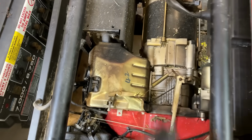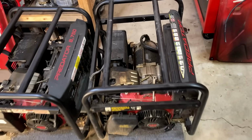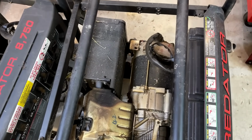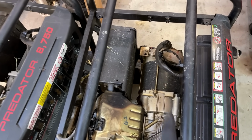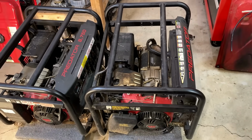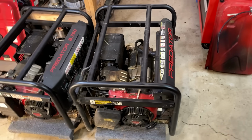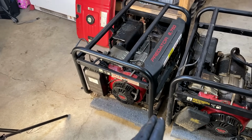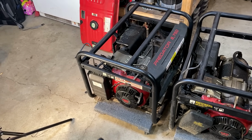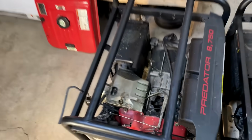You know, I'm not seeing any melted plastic, so maybe we're okay and this wasn't exposed to excessive heat, because if it was, the insulation could have been damaged on that power head, and that would be unfortunate because those power heads, they are worth quite a bit of money. So as bad as this seems to be, I think there's a much bigger problem. This is the one with the blown connecting rod. We looked at each side of the block, seemed good, but now that the tank is off, I can see we have a major issue here.